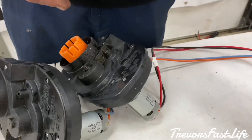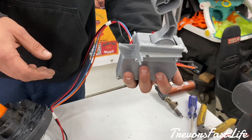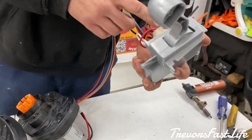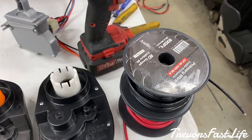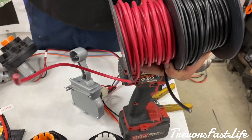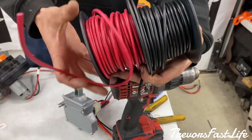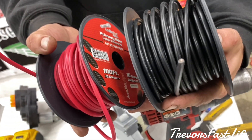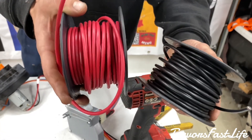You're going to want to remove everything from the car and just restart with all fresh wiring. Here's the shifter — you can actually remove the shifter and do away with both switches and just use one of the switches. One of the most important things I can't stress enough is switching over your wiring. You need to get the stock wiring out of these power wheels — I believe it's only 14 to 16 gauge. You have to put at least 10 gauge or thicker on these cars. When you're overvolting them with that stock wiring, they tend to get real hot and catch on fire, and that's not very safe for these kids.